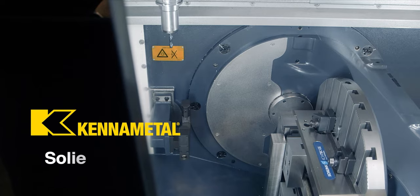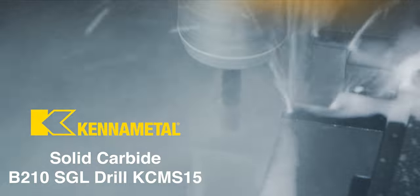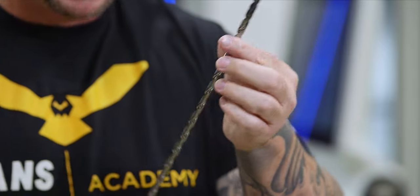Now, when we look at the SGL, we have different sizes. We're gonna have a nice stubby drill. That's gonna be our pilot drill. So we're gonna step into the material and actually drill down to 1.2. And that drilled hole will become the pilot for this guy. This size is a 40 times diameter drill.